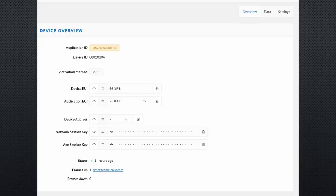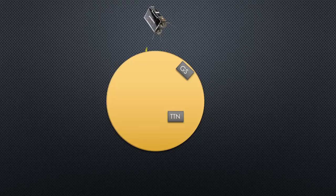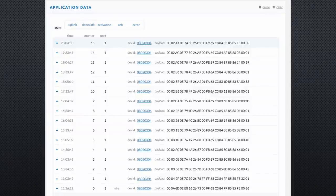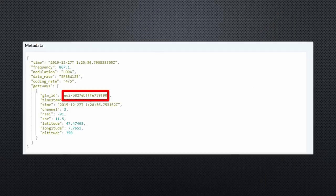Because the satellite acts as an ordinary TTN gateway, I can set up my node as a device in the TTN console. If everything goes right, the messages will be collected and stored by the satellite if no ground station is available. As soon as one is in its footprint, it starts to download the messages and the ground station transfers them to TTN. It is now later in the afternoon - I already got messages from my node? This is impossible, the next satellite pass is only in the evening. Let's check which gateway received the message. No satellite - it is my own gateway. The satellite node is in its reach, so the clever bugger sends its messages through gateways if available, like my smartphone which connects to free Wi-Fi to save on the mobile plan.